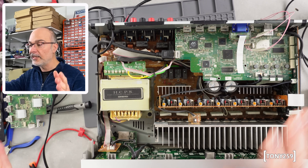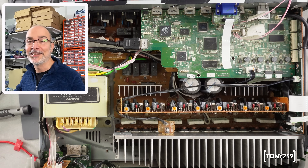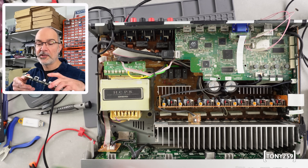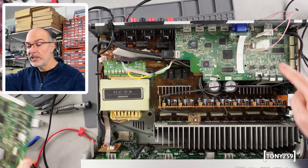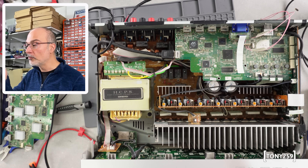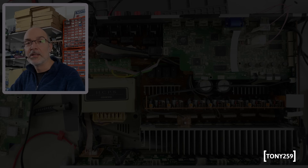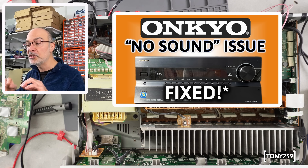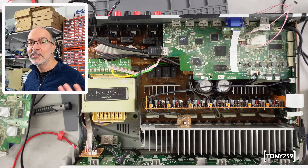So that's it — all I need to do is finalize, put all the screws in, check all the channels, and hopefully I can find a new home for this receiver. Before it goes I'll make sure to transfer all these heatsinks onto these ICs, and I'll get another one for the ARM processor, because that's the one that gets pretty toasty. Hopefully the D revision is not as sensitive to heat and age, but I think it's just a good idea to have a heatsink on it. Nothing too special today, but I'm really happy to see this receiver working. If you want to see a bit more on an Onkyo repair, just go on the main channel and check the Onkyo 3007 repair video, which is a bit more interesting and challenging.